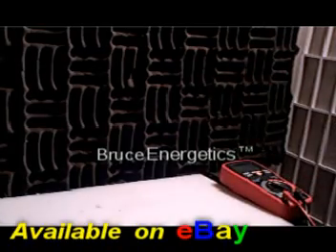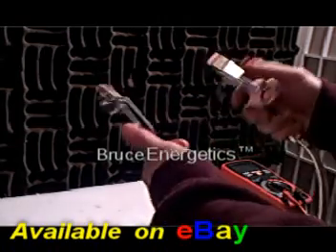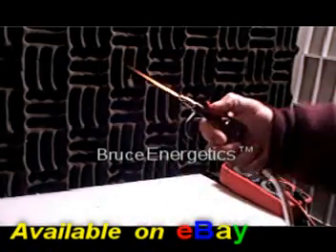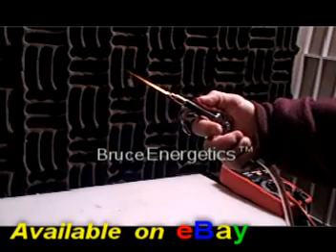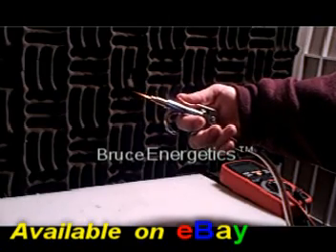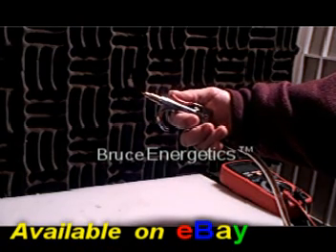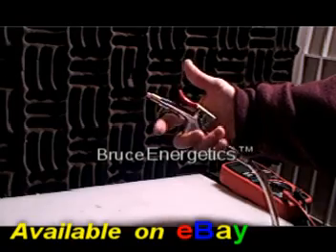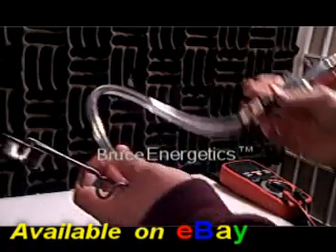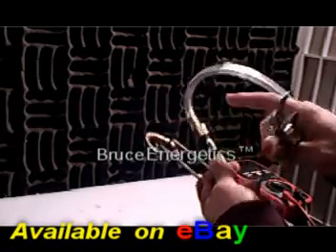It's very convenient, very handy. I'm going to show you what happens if you turn the power off, or if for some reason your cell breaks down and stops flowing gas. What happens is you end up with a situation where the flame will slowly decrease in size and eventually it'll flashback by default. So that saved your equipment from any damage — no flashback in the tube. Always have a backup flashback arrester. You never know.